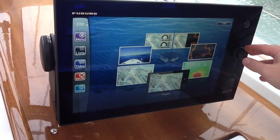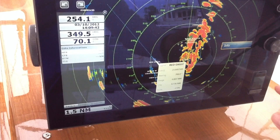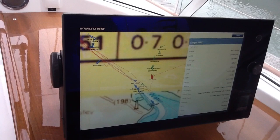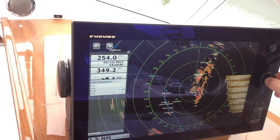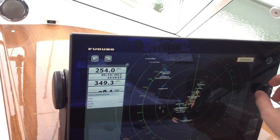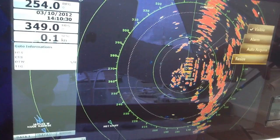We're going to have a quick look at some of the AIS targets on board. The Red Eagle — that's one of the ferries that goes over to the Isle of Wight. If we look at the information, you can see that it runs from Southampton back to Southampton again. I'm just going to zoom in a little bit. What I'm doing there is just resizing the guard zone. With the guard zone we can set up alarms that are specific to our guard area. The radar is just restarting itself at a lower range, and it's actually spinning faster now because we've zoomed in. You can see how clearly and in high definition it is — each of the pontoons is clearly visible along with all the little targets moving around us as well.